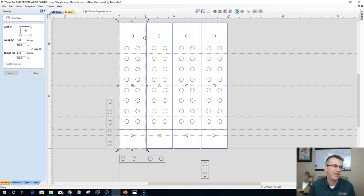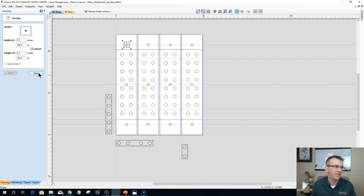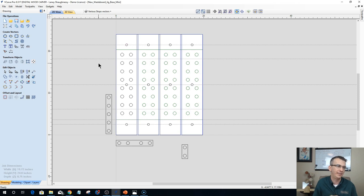The slat width is 4 3/4, and of course your holes are drilled for your T-track holes at 2 3/8 on the center of that slat. So 4 7/8 was a misspeak last week when I was mentioning this particular waste board, William Edlin.